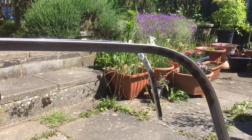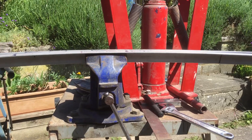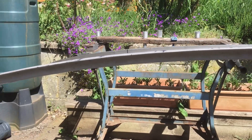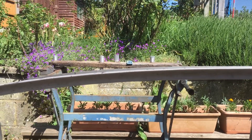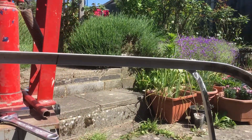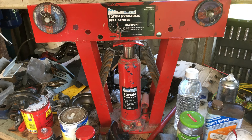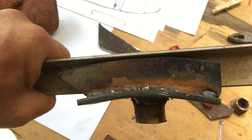In this video I've decided to show how I've built the new boat tail for the rear so it looks a bit more cool. I decided to use stainless steel angle iron. The problem with angle though is when you go to bend it, it kinks in two ways, so I came up with adaptations for my tube bender to hold the angle straight as it was bent, and it did seem to work quite well.